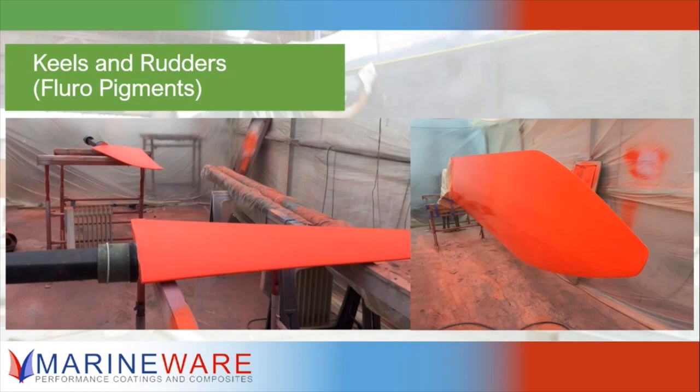What's been remarkable is using Duropox on lifting foils — its wear and tear, toughness, and durability going up through sliding foils has been amazing. Going back to the America's Cup in San Diego with the AC75 boats on foils, they found the limits of the normal Duropox clear. The hydrostatic loads trying to rip the paint off the foils were so high, and the foil loads going through into the hull cases were also very high, so they needed something tougher — hence Duropox Extreme was developed.